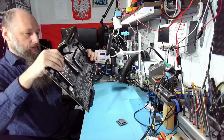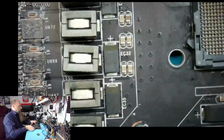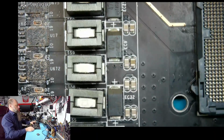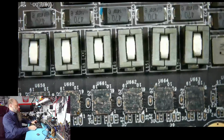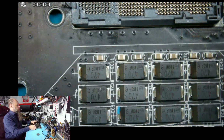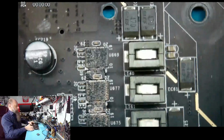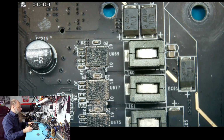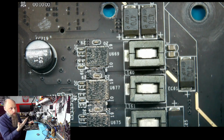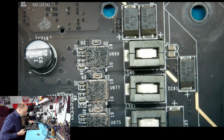port, and HDMI. The caps are all, well, not all of them, but the one on the V-core, see, solid state caps, very sizable coils, right? I wouldn't even expect the 1151 socket to have this much of a power requirement. So this most likely looks like it would pull the most powerful CPU that you can get in the 1151 package. Very interesting.